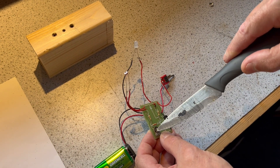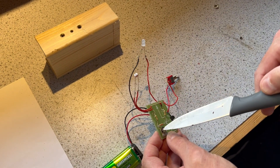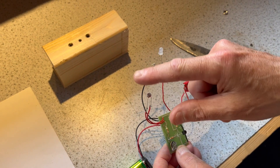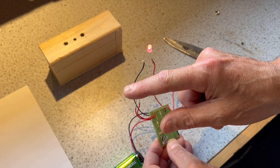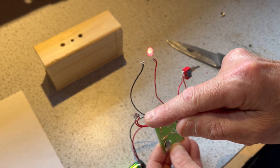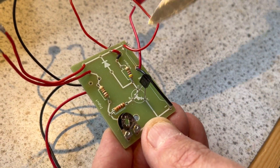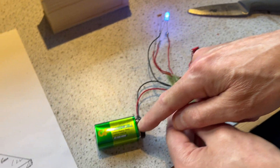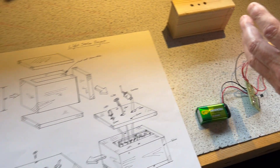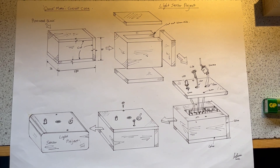With a little knife there — let me just adjust that very slightly back. There you go — it's a really effective little circuit, very sensitive. Can you see it? The camera is picking it up. It has: LDR, LED, transistor, variable resistor, and these fixed resistors. It's a very simple circuit but it works — of course a single-pole switch and a PP3 9-volt battery.